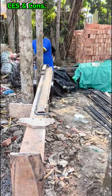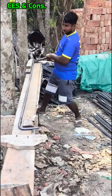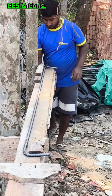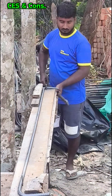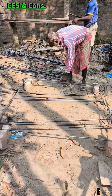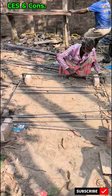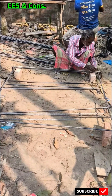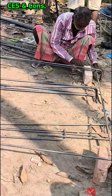This reinforcement is a mesh. This reinforcement mesh is placed below the vertical bar cage of an isolated RCC column, which serves several important structural and practical functions. This reinforcement mesh is designed based on the load on the columns, column size, and soil bearing capacity, ensuring the structural safety and durability of the column footing system.